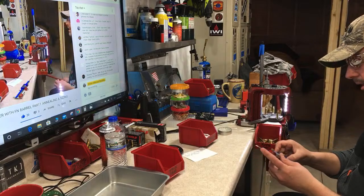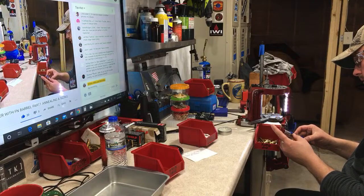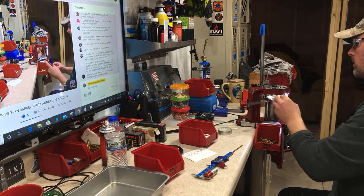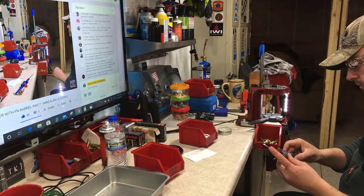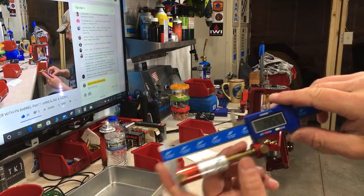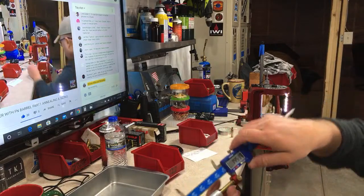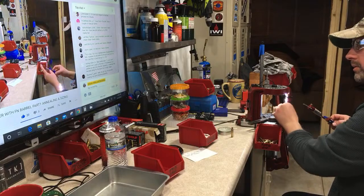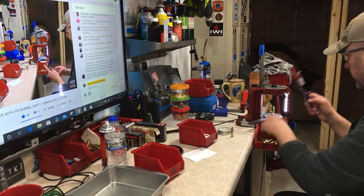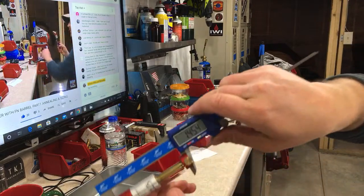All right, so let's check this out here. 453. Now this one's 454. I'm actually going to run this one through again. It's been a little stubborn. So you can see now my headspace is starting to veer off. It's 454. This one I ran through twice. I went down to 453, but you can see the die is starting to become unconditioned. 453.5 and yeah, 454.